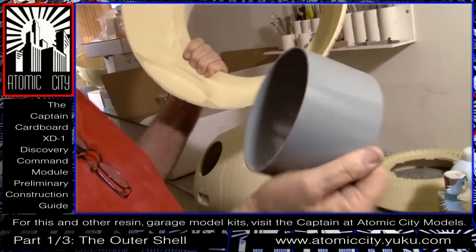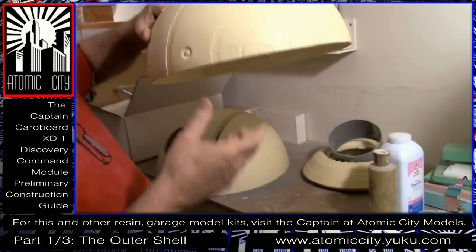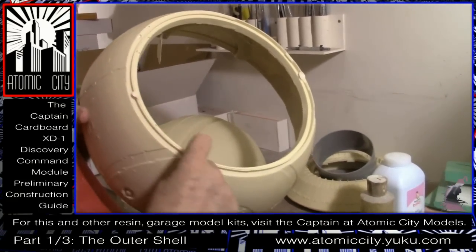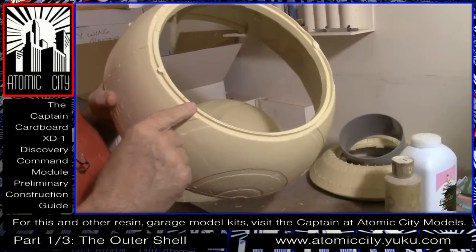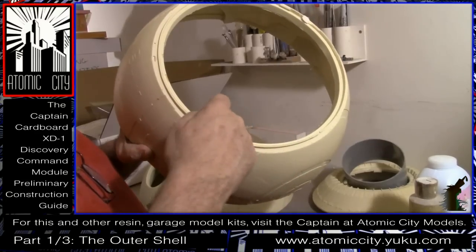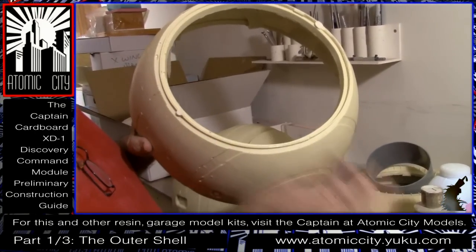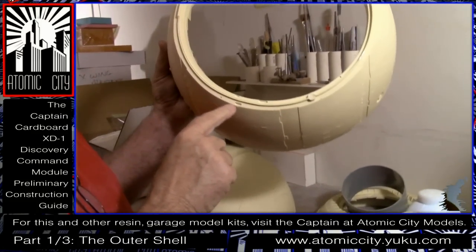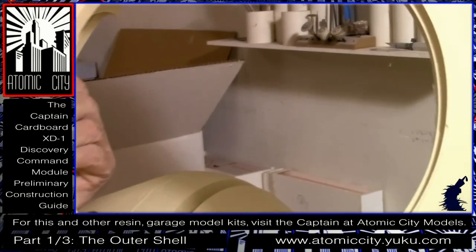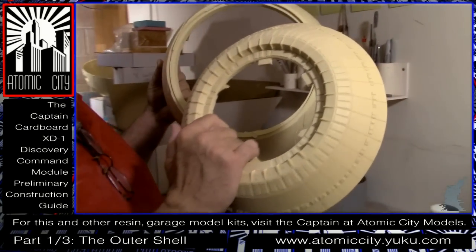Well, it doesn't have to key. That's the issue. At one time it did. I see. But now it doesn't. That's what happens. On the back of the back, there's a fin in here. And this is simply what is referred to as a bubble fin, which means if a bubble appears in this surface that you want, it will hopefully go into the fin, and then you take off the fin and you've gotten rid of the bubble. However, as you can see here, that didn't happen. Right. But at the same time, those are easy to fill. So just remove this, and then this piece, known as the collar, will fit perfectly.